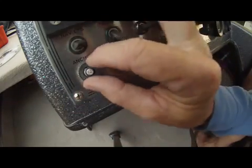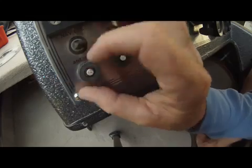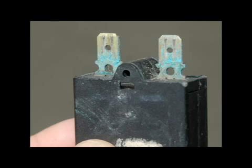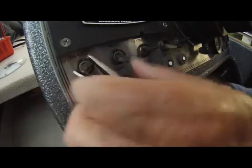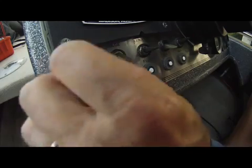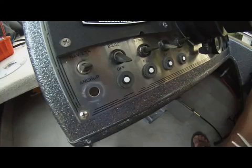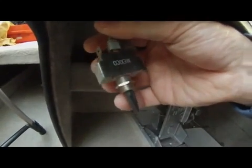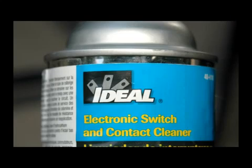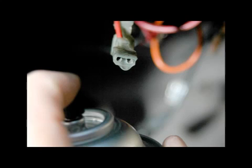I wanted to make sure my wiring under the console wouldn't let me down while fishing. The first thing I did was remove the circuit breakers — one at a time so you don't get any wires crossed. The circuit breakers were badly corroded. I found replacement breakers of the same model and brand, so I bought new ones. I decided to keep the switches but clean the terminals, again removing them one at a time. I used a contact cleaner specifically made for this, spraying it on the terminals and pushing them on and off to ensure a good connection.